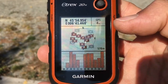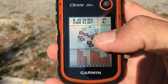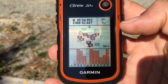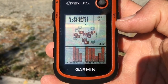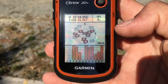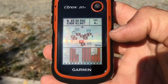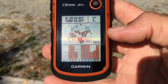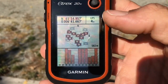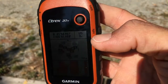Just below these two pieces of information, you have the sky view of the GPS, which shows the satellites it can actually detect. Here we have lots of satellites — maybe 8 or 9 — and you have the signal strength for each satellite. You can also see the altitude here. To determine position, the GPS needs to detect at least 3 satellites, and for altitude it must have 4 satellites. Now that the GPS is fixed, we will check on the map where we are.